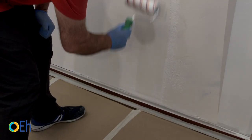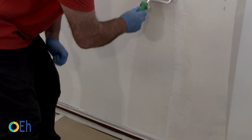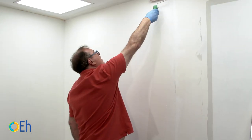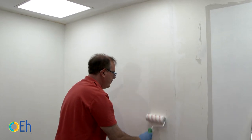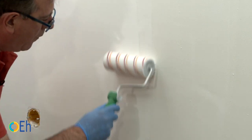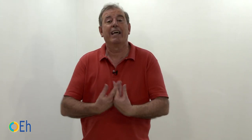We're going to dilute the primer with a ratio of one to four — one part primer and four parts water. The surface flatness must be respected using a roller that does not give texture before applying the paint. I'm going to use a medium 3/8 roller, which is the same that I will use later to apply the satin paint. This part is essential because 99.9% of the queries you ask us — like when you say the roller leaves marks on the surface, I get bubbles, there are unequal areas of paint — all this has to do basically with not having applied this primer well.